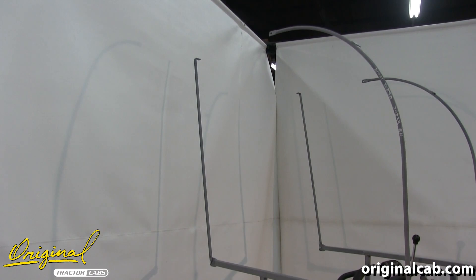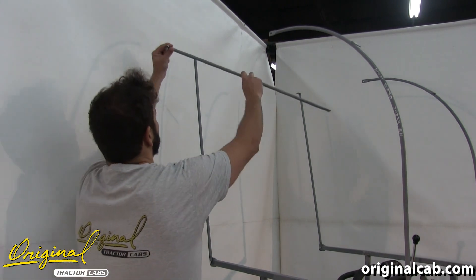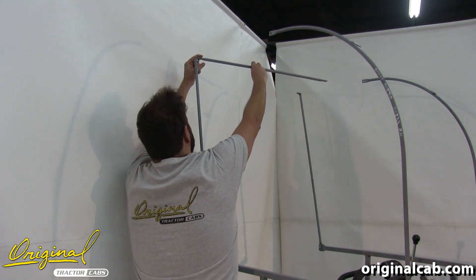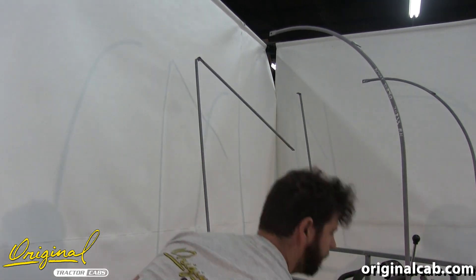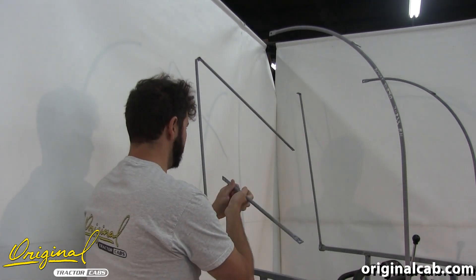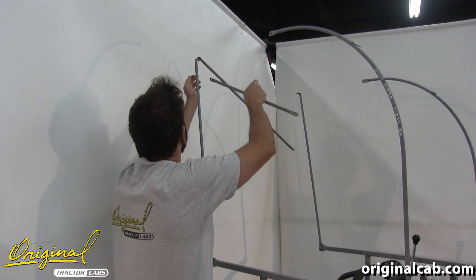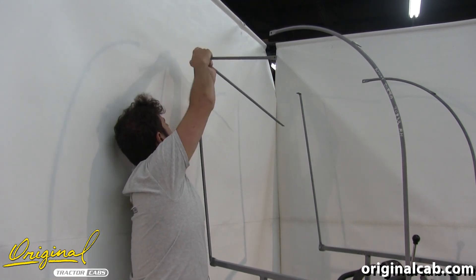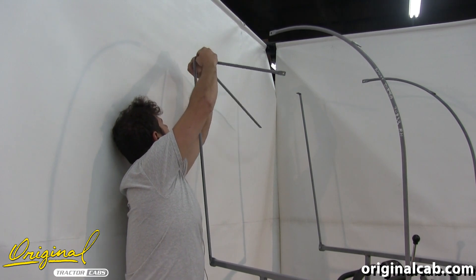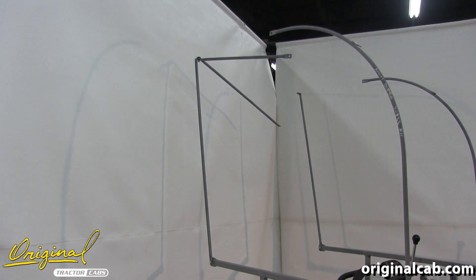Next we'll install a straight tab crossbar and the two short connecting bars. We'll start by placing a quarter by three-quarter bolt down through the hole in the crossbar, then go into the rear post. Then add the short connecting rod and add a nylock nut. Then do the same thing for the other side.